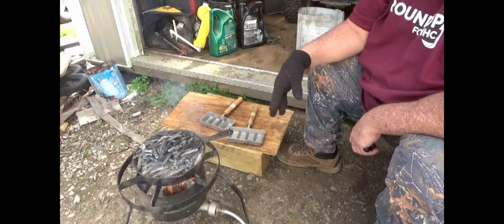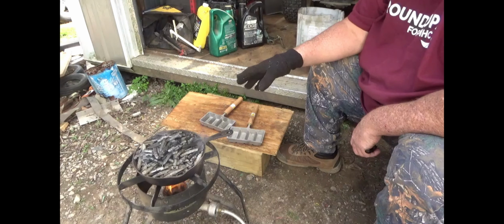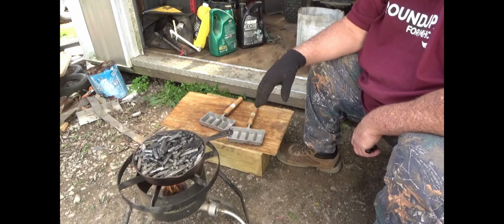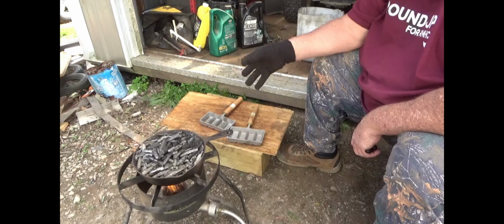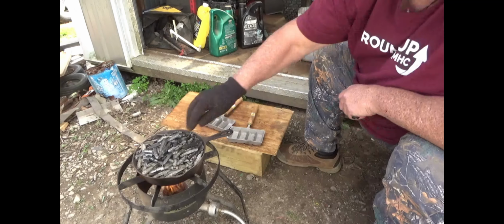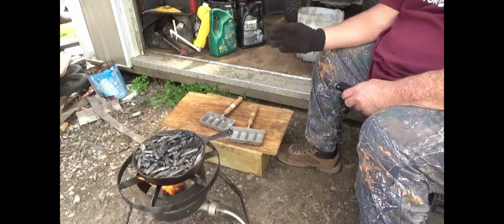You'd have them up this tall. But you can add to it as they're cooking down, and you'll tell when you're about at the limit of what you can do. And once they get cooked down where I think I'm good and full, then I'll start skimming off those clips and all the garbage that's in there, and working down to getting just the lead that I want, and then we'll flux it off with some wax and go from there.